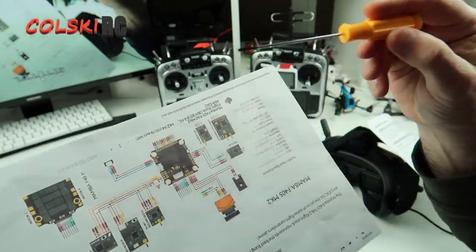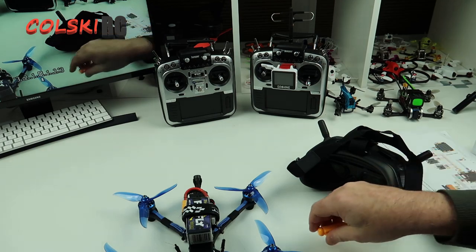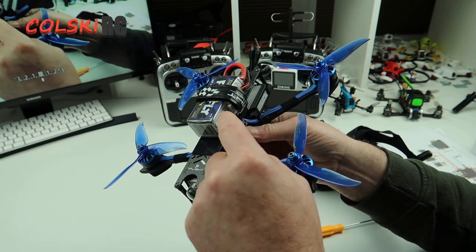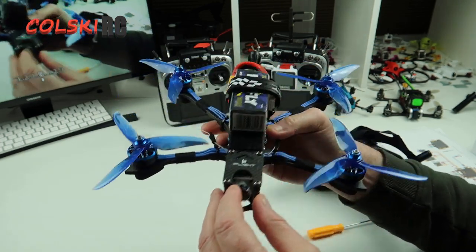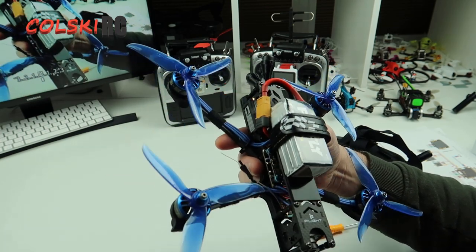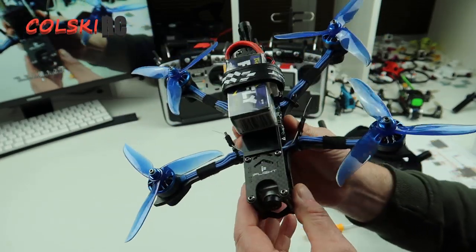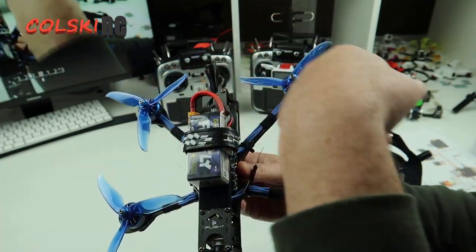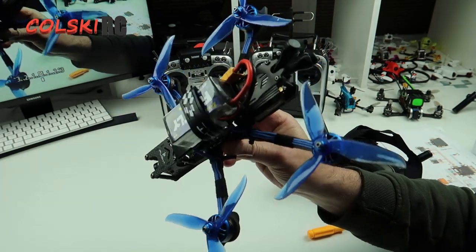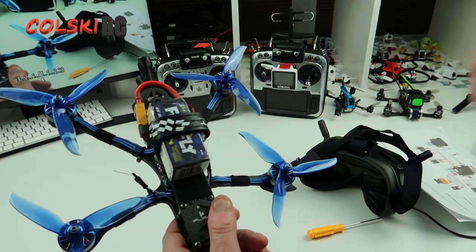I turned UART 6 on as I mentioned, but when I did that I had no battery voltage showing at all. I messed around a bit, went on the internet, and some people were saying it doesn't work on certain boards, which I found strange. Anyway, I connected it back up to the DJI Assistant and found there was a firmware update — did the firmware update on the goggles and the air unit, and it now works absolutely fine. It was really a quick build — took about an hour and a half to two hours, including the time messing around with the wires to get it working.